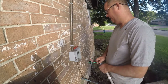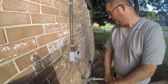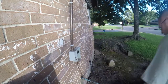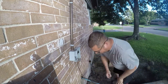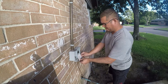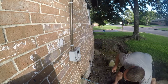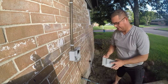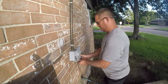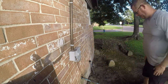I need to get a plug to close that opening, and that's really it for decommissioning here — and that can be done with the air conditioner in place. You always want to close up holes like that, otherwise critters will set up shop and get fried in your electrical boxes. It's just bad form having critters in your electrical boxes, and you'll regret it later. All right, that's it for this video — thanks for watching.